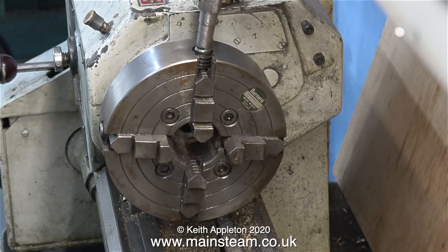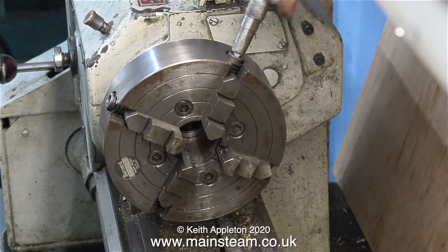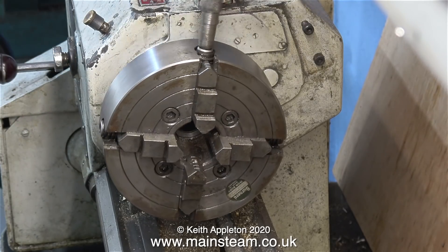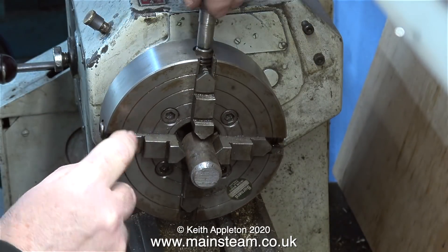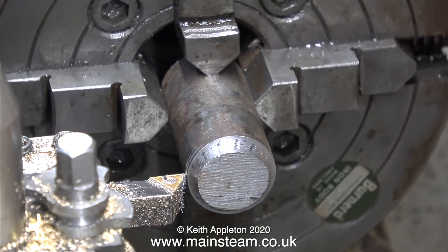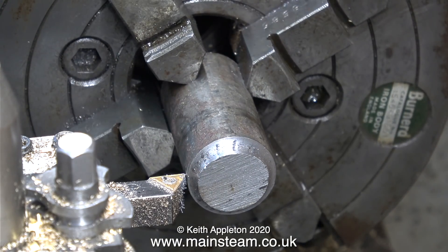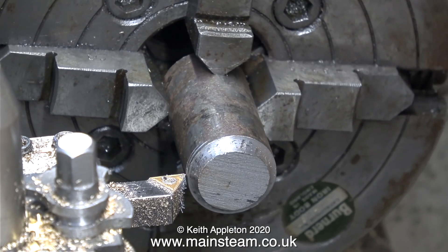The alignment begins. I'm adjusting each jaw until it goes midway between the two outer lines, and the four jaws should end up being equidistant from the centre. Here's the piece of steel going in place — a quick nip up of all the jaws to make sure it's tight. By rotating the chuck and advancing the lathe tool towards the work you will find out whether it's in the centre or not.